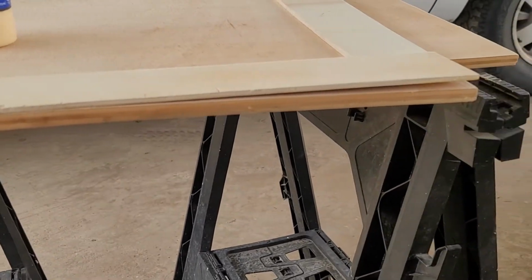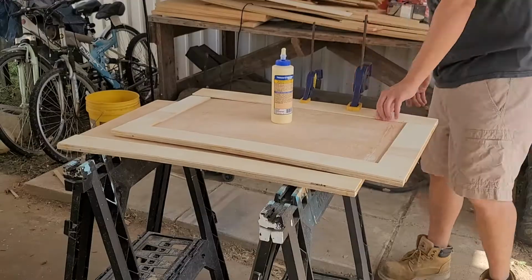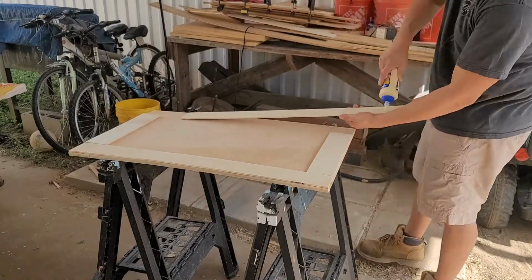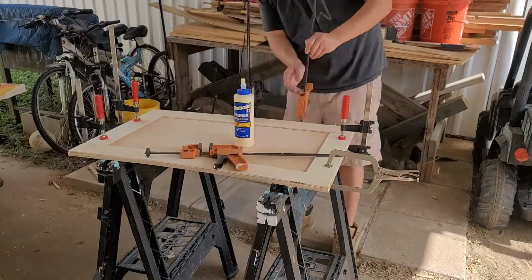You can really see the bend on the board here. The face trim of the shaker board sticks up on both ends, but with enough clamps we'll have these 2 boards stick together. So once we glue the missing face trims to both doors, we just have to wait until the following day again.